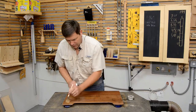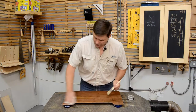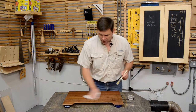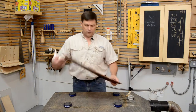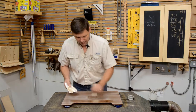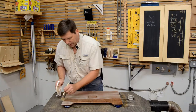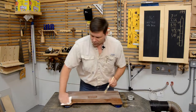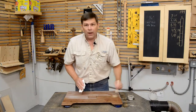After pre-wetting, sand the parts to final finish. That means when you start actually applying the finish, there'll be a lot less grain raising to deal with in between coats. After pre-wetting like this, the finishing process becomes pretty much the same as if you were using oil-based finishes. Try it — you'll find it useful.